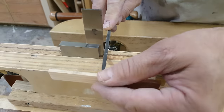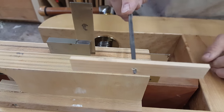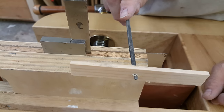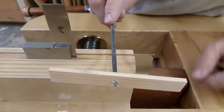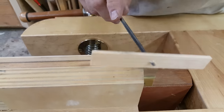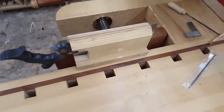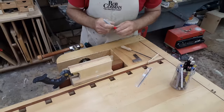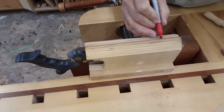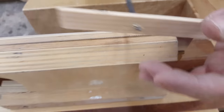And I'll stick this piece of wood in the end. Now that will help me keep this — this stick is easy to keep it level. I can tell if I'm tipping one side or the other, and that will keep this side standing plumb. Now if you need to, you can go in with a felt tip marker and you can paint the teeth. That'll just help you see which one you did, which one you stopped at. But I've gotten past needing to do that.